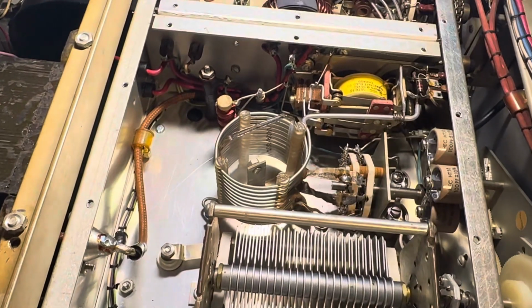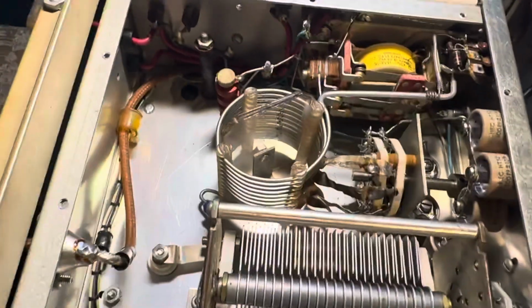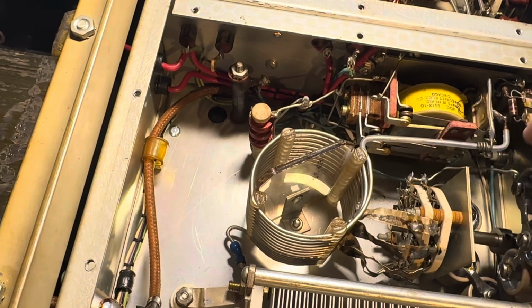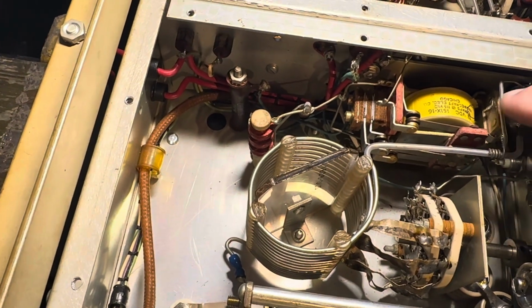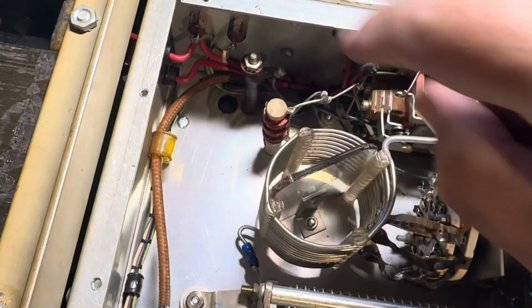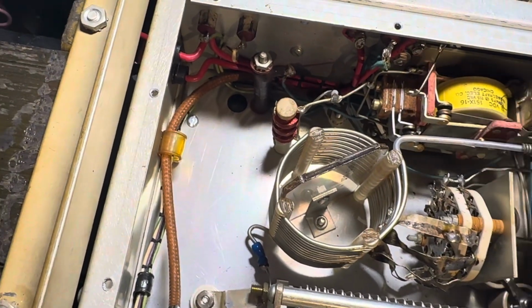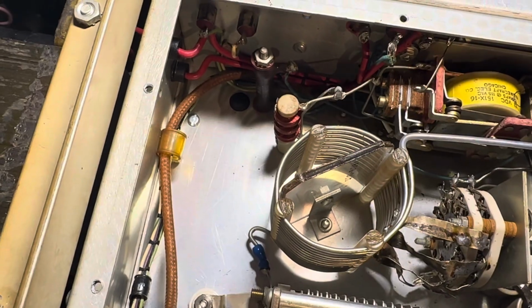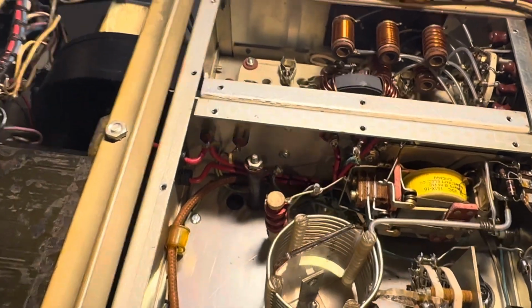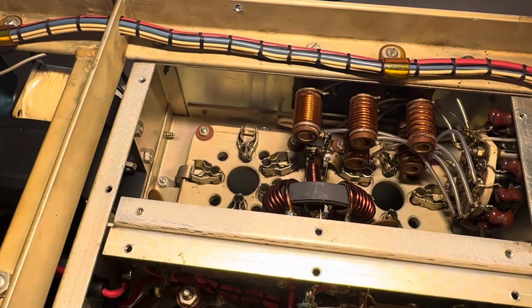It should run. I went all through here looking for shorts, looking for open resistors, looking for bad diodes. I couldn't find anything. One little diode right there, which is fine. That resistor was good. I'm guessing that relay is okay. Looking for shorts in here, couldn't find anything. So I think that's all copacetic. I'm just assuming that all that works in there.